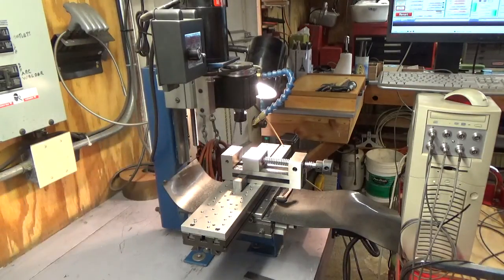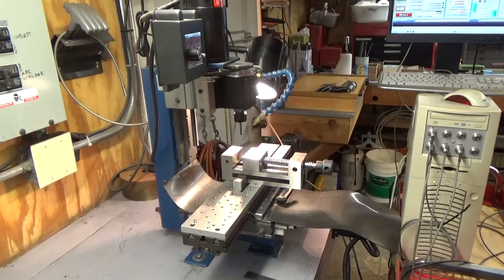I'm happy with that. So that's how you make a square hole — I think that's the solution. I'm pretty sure after using the three-sixteenth-inch end mill that an eighth-inch will work too, and I can probably buy an eighth-inch end mill with a longer flute. But actually, maybe the way to do it is just use the three-sixteenths — I don't see anything wrong with that. The heck with making a square hole with the shaper. I'll post this video or stick it up on the Dropbox.